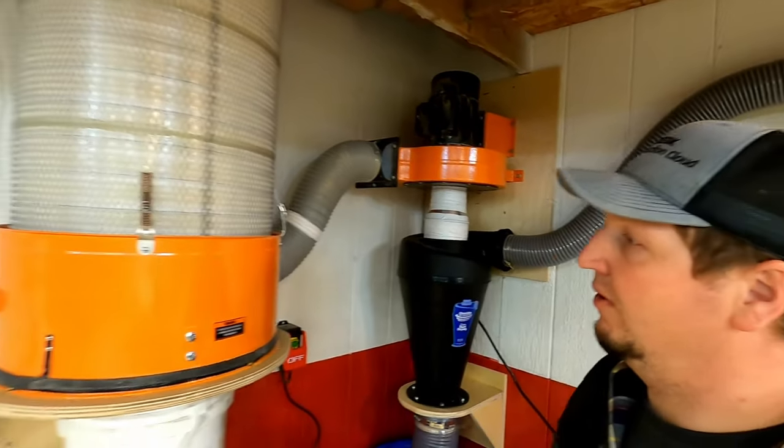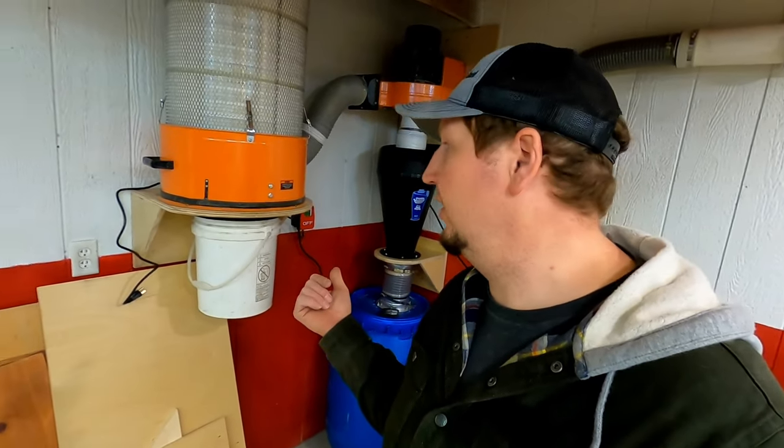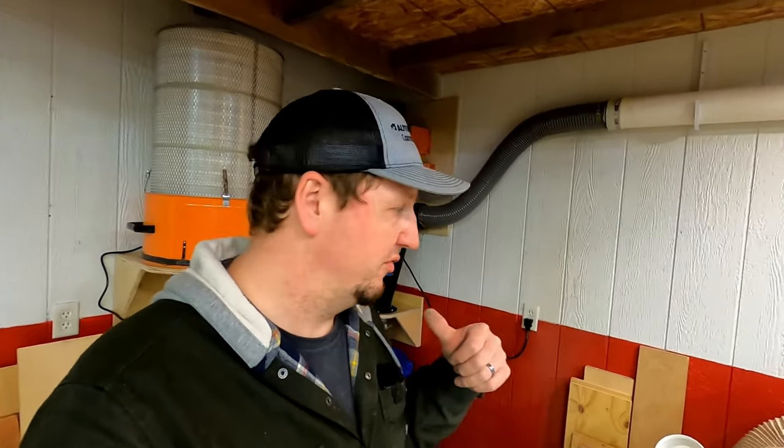So that's it. I will do an update video in the future, so subscribe to see that, to let you know how this is working out. Initial tests are the wind speeds at my table saw are going to be increased compared to what it was before. Before it was like 51 to 52 miles per hour. Now it's 60. I think my wind speed meter maxes out at 60 miles an hour. Definitely is going faster than that. The other improvement of this dust collector is it seems quieter. It's not as loud as it was before.